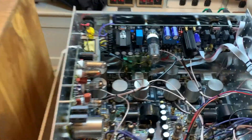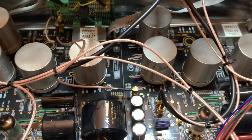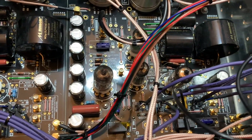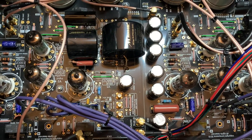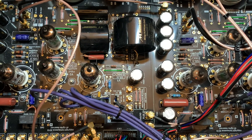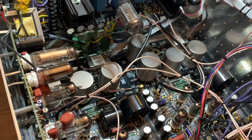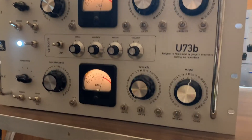Valve-wise, the E99F valves on the input — there are four of them in the unit in total. They're actually quite cheap, though they're quite difficult to find as a matched quad. I've got GE valves in there, although I've tried a few others and not noticed a huge difference. Similarly for the E88CC valves — I did buy some Telefunken ones, they were quite expensive, and one of them failed — so I've got some Yugoslav EI valves in there now. Not too pricey.